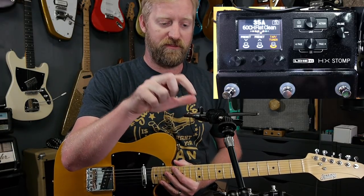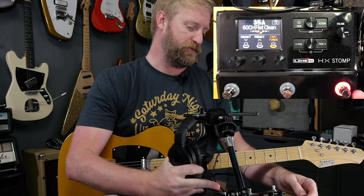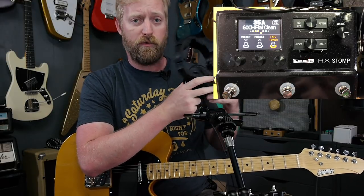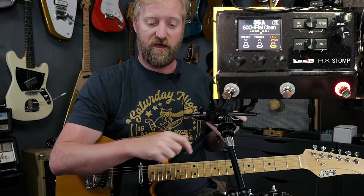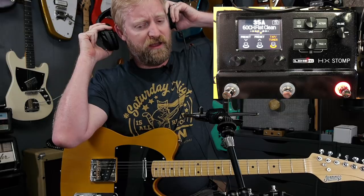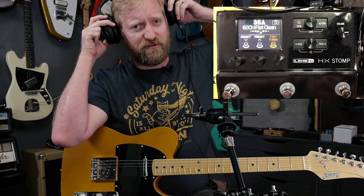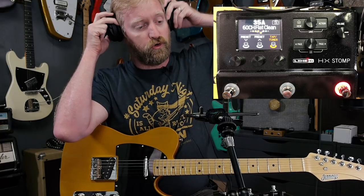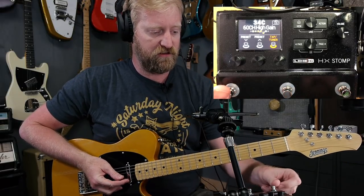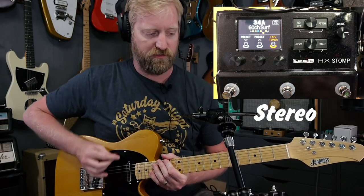All right, let's press record on that. And now I'm going to plug in my headphones. By the way, there's a couple of headphone options for me. I'm going to plug into the Stomp on the left side of it for the best sounding option for the guitar. But if I want to hear my voice, or I'm doing interviews and need to hear everyone else, I can plug into the Zoom H6 and hear the full mix out of that. It's just a little bit crispy and lo-fi out of the H6 headphone mix. It's not fully representative of the signal as it's actually recorded. All right, so here we go. We'll start off with my surf setting here, and I'll go through how I built this.